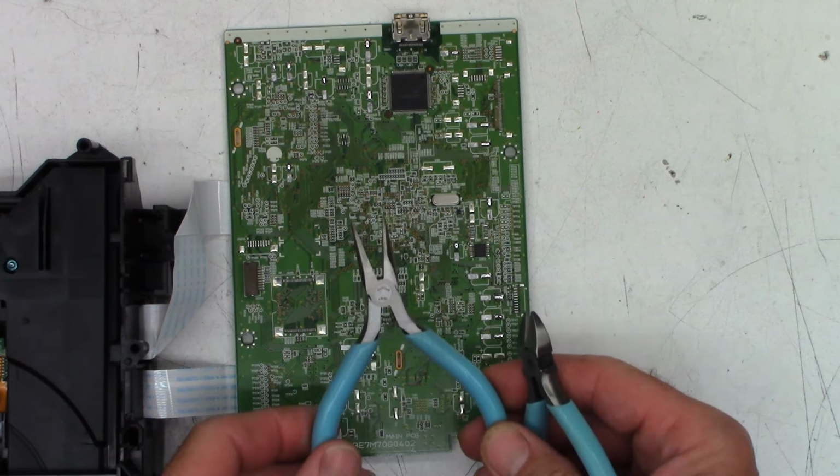And you can see that the black rubber mat that goes around the turntable itself is much, much better. There was a bunch of gunk and hairs stuck in it. So I did have to, one moment while I zoom out, macro zoom does become very much disabled. I did have to go ahead and remove the magnet assembly once again. And it just goes in like that. I'll close the drawer and I'll slide the tabs over to move the optical pickup back into position here. And I know it's not macro zoom enabled at this moment, but I just want to make sure I did not touch it with my finger. And it looks good. Okay, let's put this thing back together.